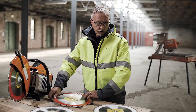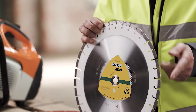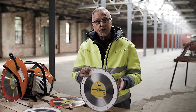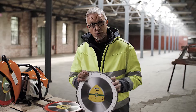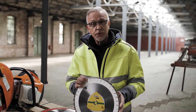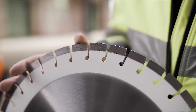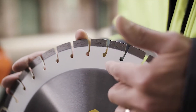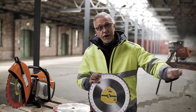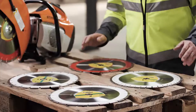The next type of segment I'd like to look at is the short tooth segment. Because there are so many sections very close together, this gives a very fast cut — this is one of the fastest cutting designs that you can use. A big benefit with the narrow gullets between each diamond segment is also the quality of the cut. It gives a very nice finish, with sharp edges to the components being cut.